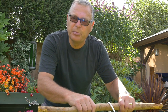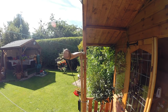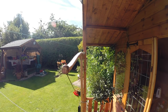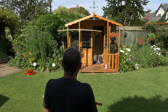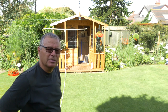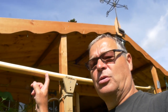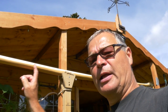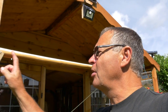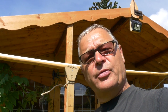So here goes — this is the first pull of this yew longbow. That's about 80 to 90 pounds on the long string and it hasn't broken. I don't want to leave the bow pulled for too long on the tiller, but I think I saw a weak point here in what might be the bottom limb, just below the handle, and here on the top limb this section didn't seem to move at all. So I'm going to take a little bit of wood off the belly and see what difference that makes.